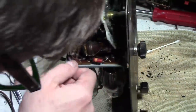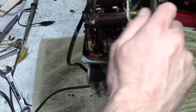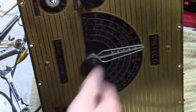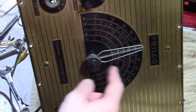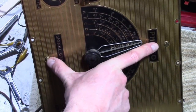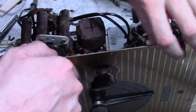I'm looking in to see how the sub-chassis is held on — it's held on by screws, one here and one on the other side, and then the whole sub-chassis would loosen up. But how do you get at those screws? They're behind this decorative cover, so that would have to come off. That means pulling the remaining knobs off — those are easy enough — but this dial is held on by a set screw, and taking that off would screw up the calibration. Once those are off it's held on by two screws, and I won't have to remove any of the controls themselves, just get the knobs off.